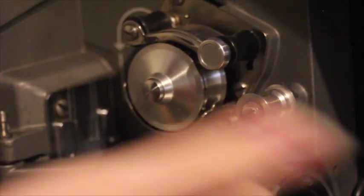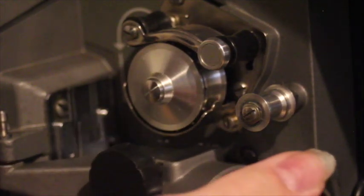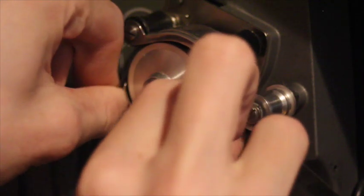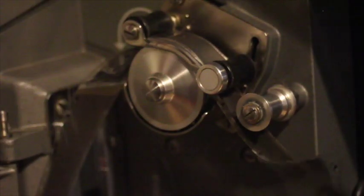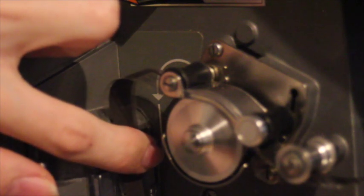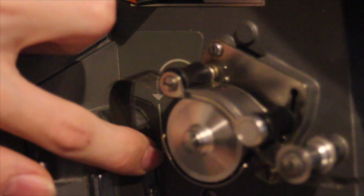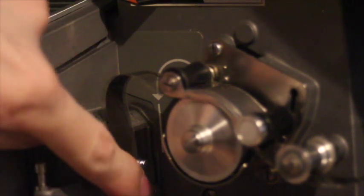Make sure the film gate is open, which we do by using the focus dial and a thumb as leverage, and it swings open — it's just a little catch. Put the film underneath the first roller and on top of the sprocket wheel. Line up the teeth and then lock it down, making sure it's nice and secure. Take out some of the slack. Here is the important part: we have to form our loop. Just align the film with the loop guide and tuck the film underneath the bottom roller. There we go — we've now made our loop, and we're going to close the film gate.